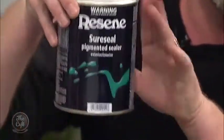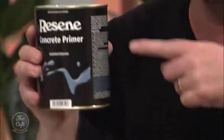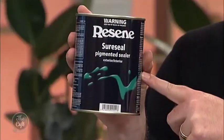And then there come things like if you're going to paint brick, etc. Now, if you want to paint brick, there's two ways. Old brick, you're going to need to use a Sureseal primer on the brickwork, because it can be chalky, and then you can paint over the top of it with your regular Lumbersider, two coats. Now, if you've got really new concrete, you can just use standard concrete primer. The difference here: water-based, easy to clean up. Sureseal, oil-based, hard to clean up, very smelly, okay? Those are your two differences.